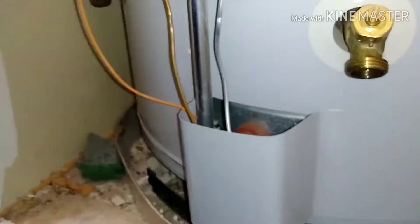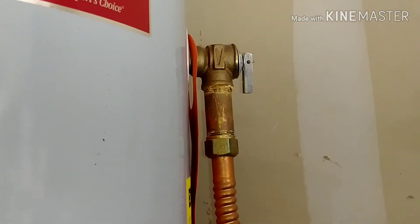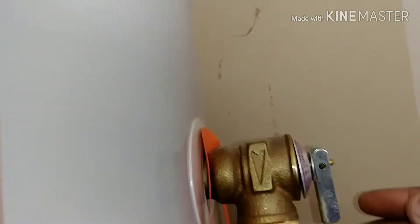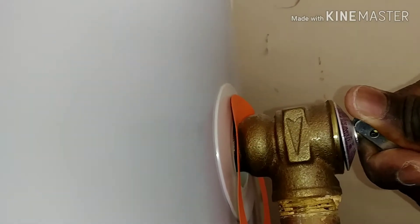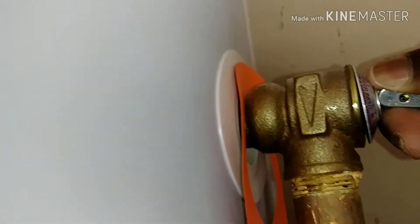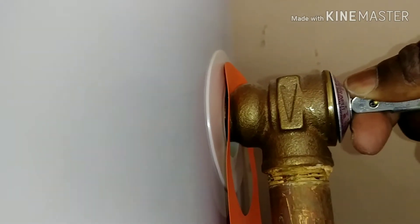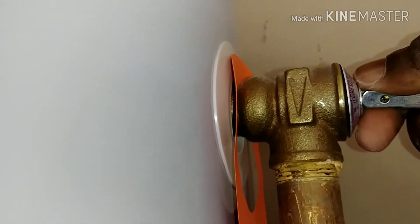I'm going to put the garden hose back on. There is plenty of water in the tank but it wasn't coming out because of the pressure release valve. What I did — and I'm still doing it — is open the pressure release valve to release the pressure and allow the water inside to drain. That will take a while since there are 40 gallons in there and we have to get all the water out first.